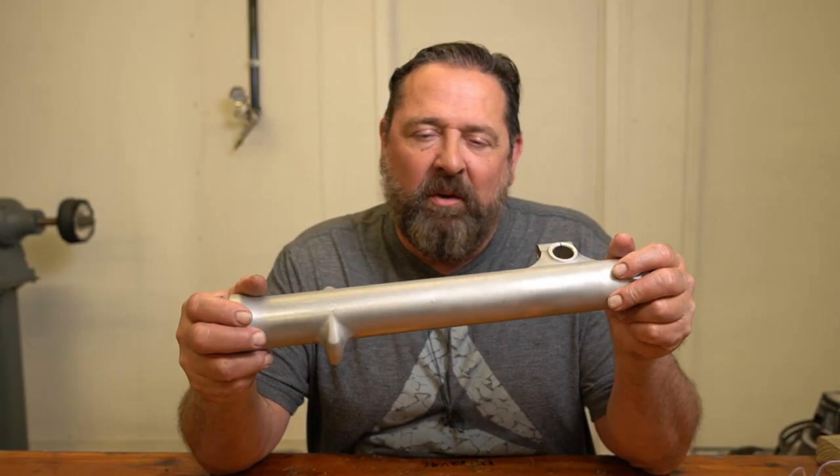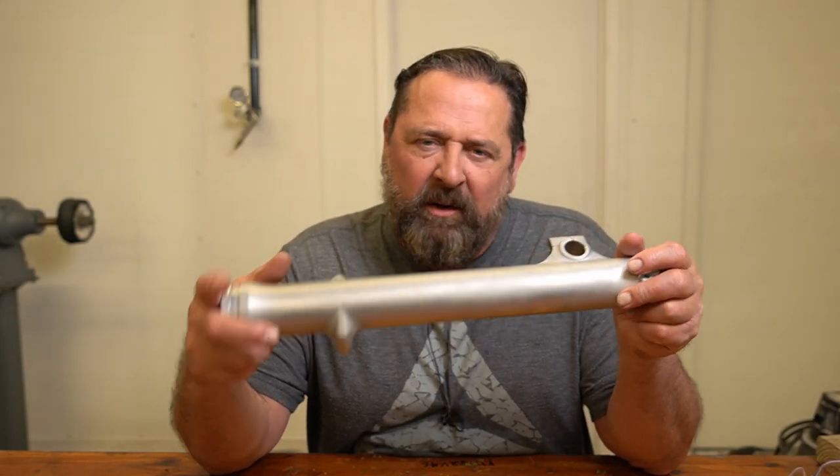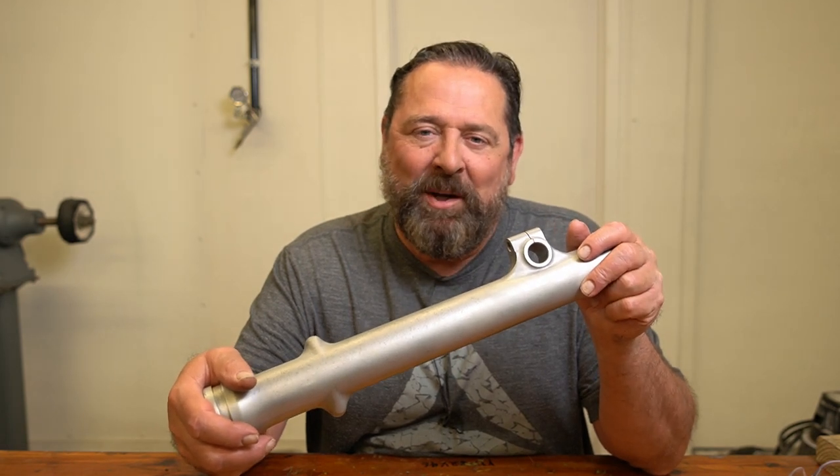You've got to realize this is just a single coat of powder coat. Doing two or three layers, that's going to take a little bit longer and a lot more elbow grease. Now, I need to make something perfectly clear: this only works like this if it's in a vat — completely submerged. If you try to just brush this on and walk away, that's not going to cut it. It really doesn't do much of anything. So you do have to make some kind of little vat for whatever size part you're doing, and submerge it.